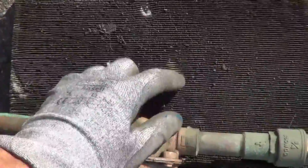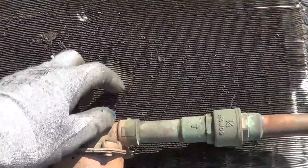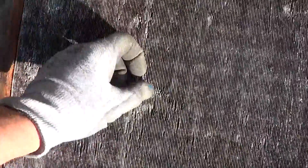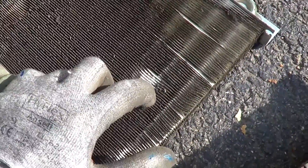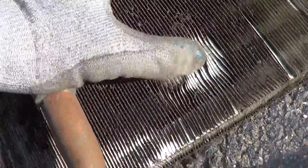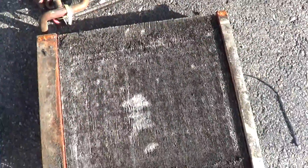Here's the heater coil out of the old unit and it's getting pretty stopped up. Here's the cooling coil — looks like it was cleaned with acid at one time. The fins, see how they're flaking apart. You always want to avoid acid on these coils; just clean them with water or a vacuum. Versus the heater coil — see how it doesn't flake. Cooling coil, see how it's chipping and tearing. Heater coil doesn't tear. So anyway, it was time to change this out.